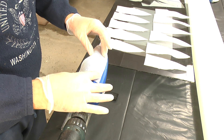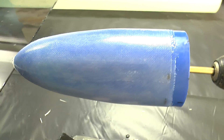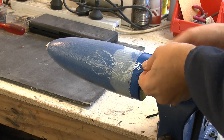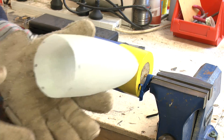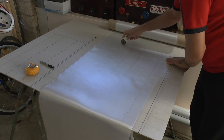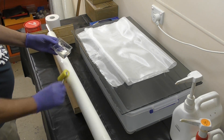Let's have a look at how it's made. We first make the nose cone — this is made out of fiberglass using a process very similar to how we made the pressure chamber end caps. We use a mold with a couple of balloons over it and apply a number of gauze layers to form the shape. When it's cured we remove it from the mold, then it gets sanded and trimmed. The very tip is 3D printed out of PLA and epoxied into the fiberglass. Next we need to make the main body tube of the deployment mechanism, also made out of fiberglass, using West Systems Epoxy for all the fiberglass work.